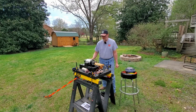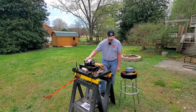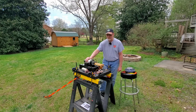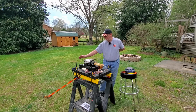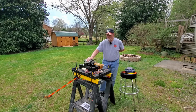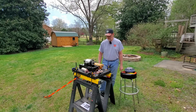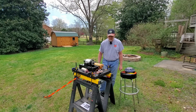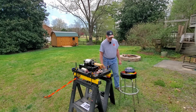All right, everyone. I've got the turbine, the new 240, mounted on the test stand. It's tied, strapped down, fueled up. It's primed, ready to go. So I'm going to test it and start it up and see how it runs. Things I'm looking for is I don't want to see excessive flames at the tail. I want to make sure that it starts and stops. We'll probably do that several times. And also I'll test the restart function and see if it restarts. It should, if it ever has a flame out in the sky, it'll try to restart itself. So that's what we're going to do.